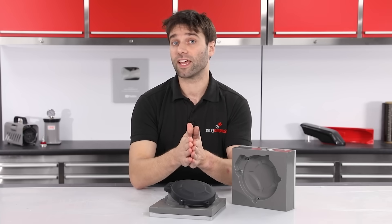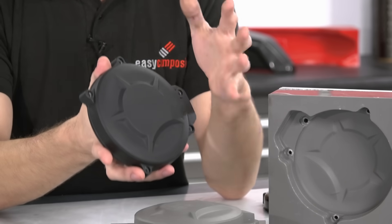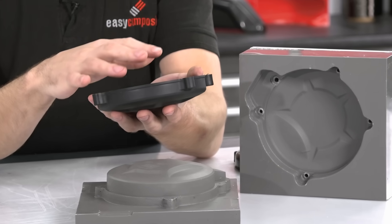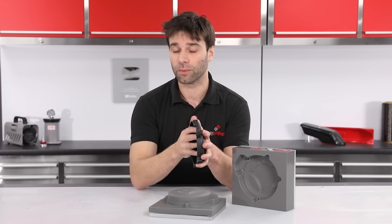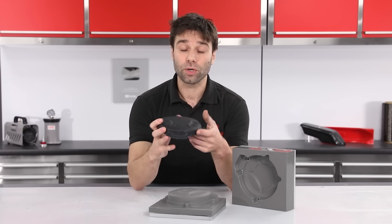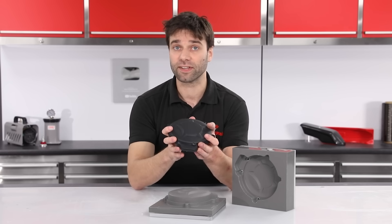The pattern we'll use to create the tools is a pre-existing injection moulding. We're going to be taking one side of the tool from this side of the part, and then the B side of the tool will come from the reverse, and that will create the offset that we need. Equally, you could use any conventional pattern making process or indeed just directly 3D print it.